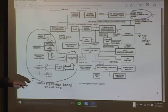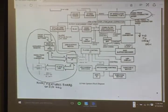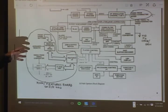Okay, I'm going to disagree with Tom Howe on this. He's got a kit or an instruction on how to put a cooling fan in this. No, that's not a problem. It's usually a connector that's oxidized in the player itself, needs to be cleaned. And every time you clean that, it's good for a period of years. I had a player in six months ago, and I had to take the fan out because it slipped and shorted something out.